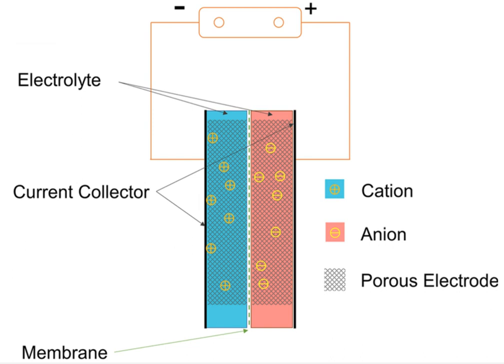At each of the two electrode surfaces originates an area in which the liquid electrolyte contacts the conductive metallic surface of the electrode. This interface forms a common boundary among two different phases of matter, such as an insoluble solid electrode surface and an adjacent liquid electrolyte. In this interface occurs a very special phenomenon of the double-layer effect. Applying a voltage to an electrochemical capacitor causes both electrodes in the capacitor to generate electrical double layers.